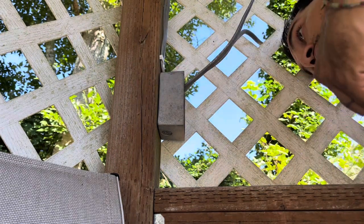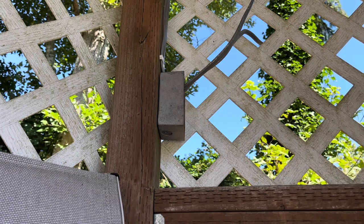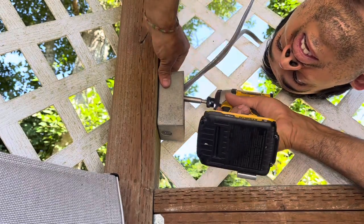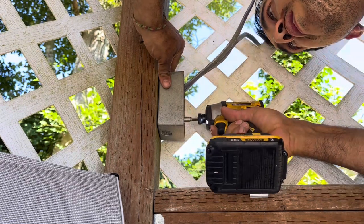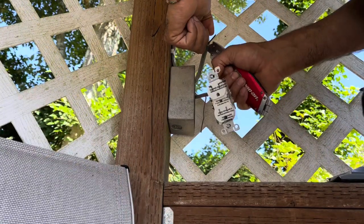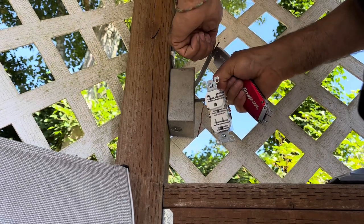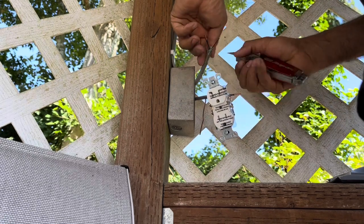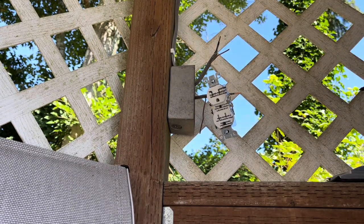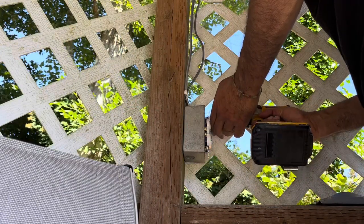Now for this one, you want your power going on the top — so your top is going to be your white and black wires. The continuation is always going to be on the bottom. The bottom outlet is going to route that power and go through to the other box. You keep doing that — power on top, continuation on the bottom — until you just have one final outlet. The top cable is where I have my power, and this cable I'm slicing up right now will be prepped and ready. The bottom one is not going to be the live wire; it's the continuation.